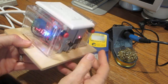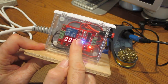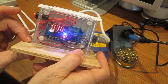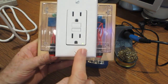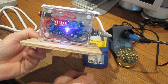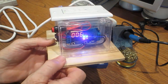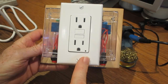Pressing the reset button starts the cycle timer. The LED on the outlet indicates it is powered. An LED also lights up on the cycle timer. Pressing the delay timer reset switch activates the cold start countdown. The LED on the outlet shows that it is powered during the cold start — in this case 36 seconds. The outlet is powered while the countdown continues, then the LED goes out when the delay timer shuts off and lights up for each pulse of the cycle timer.